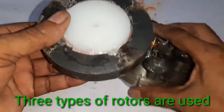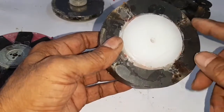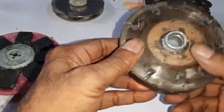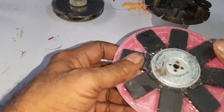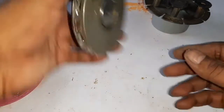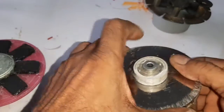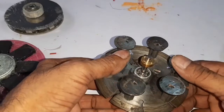There are three types of rotors. This one is a four-pole speaker magnet rotor — the speaker magnets are fitted into four quarters and fixed in opposite poles: north, north, south, south. This is the eight-pole rectangular ferrite magnet rotor, and here is the eight-pole neodymium magnet rotor. Three types of rotors are used in the axial flux BLDC motor.